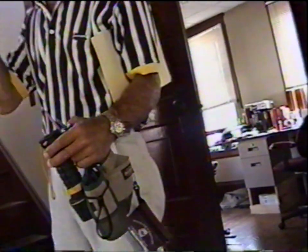For that one, I'll tell you, a few code things, no railings. You need to have a railing on at least one of the sides, that type of stuff. You need to have a railing on stairs, according to the building code, or just for safety. Is there a code done here? Probably not, but don't worry about it. My notes will say, recommend adding a railing.